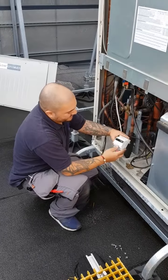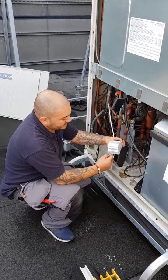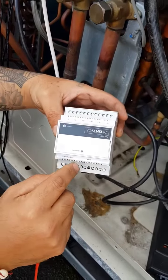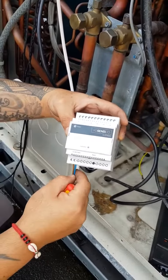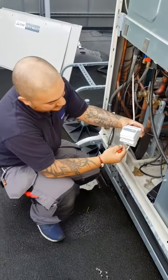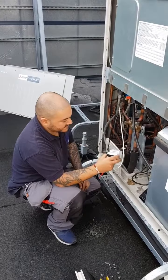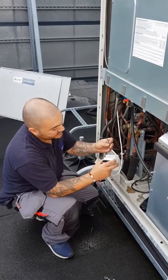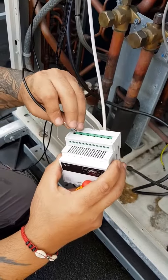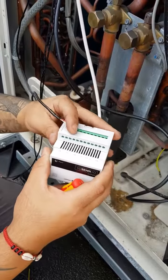Second stage, we've got single phase power into the node here. There's a tolerance of between 100 to 240 volts, so you can use power within that range — 110 is perfectly okay. Now that we've wired up the live and neutral to the power end, we're going to connect the other ends of the CT clamps onto here. The red being positive and the white being neutral will go into the top here, like so.